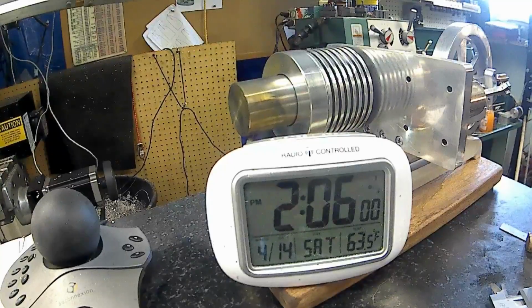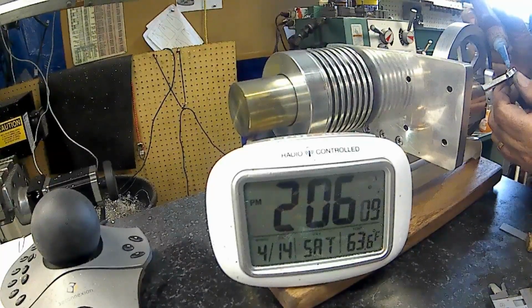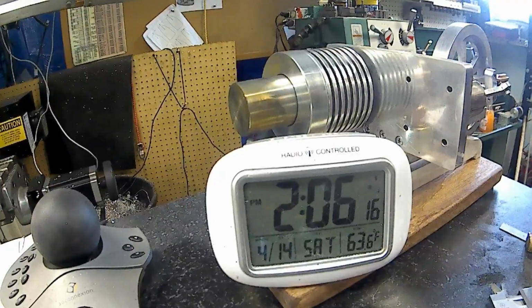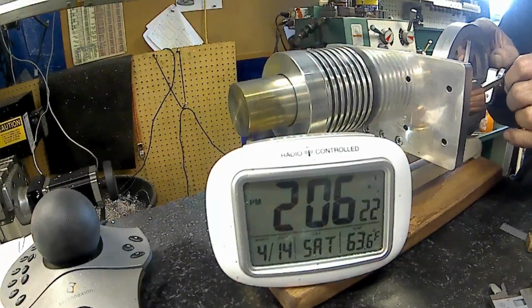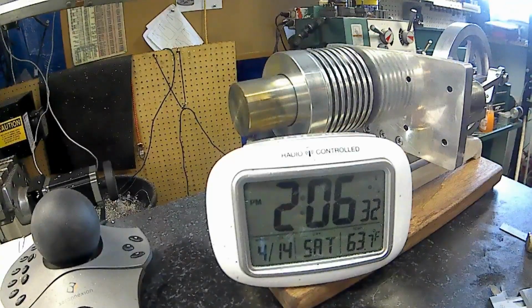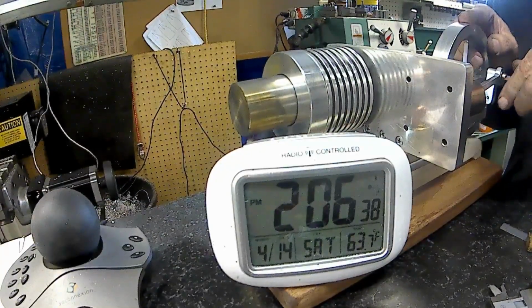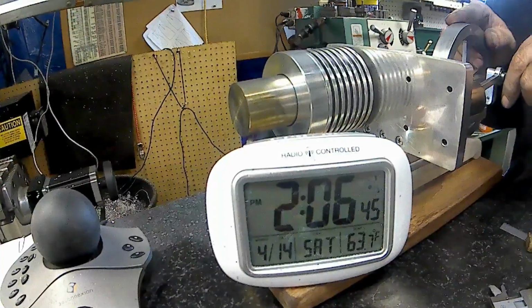That comes from touching the nozzle to your metal. If you never touch your nozzle to the metal, it won't get the ions it needs to set up, and it should never get hard if it's true Loctite, because Loctite is an anaerobic. It has to be minus air and have copper, I think it's copper ions, that it gets from the metal. Without that, it's not supposed to harden up. It's the same thing if you have a bottle of Loctite and the bottle starts to get sticky on the outside, that means it's gone bad.